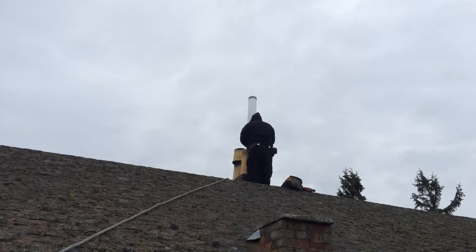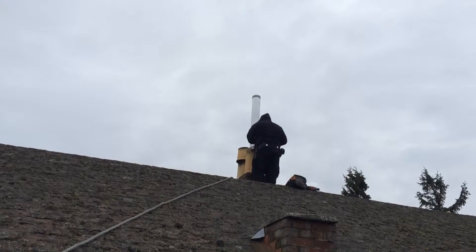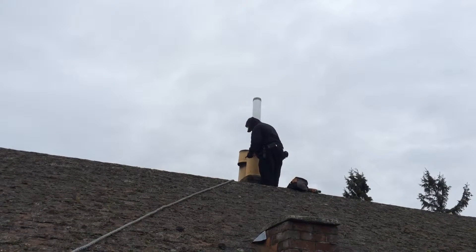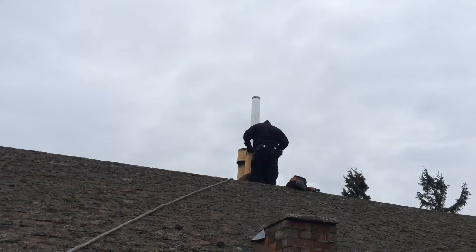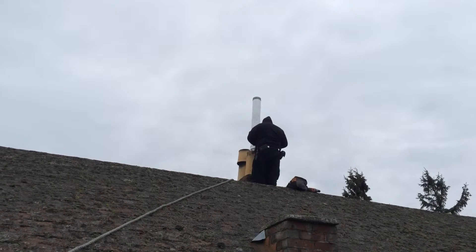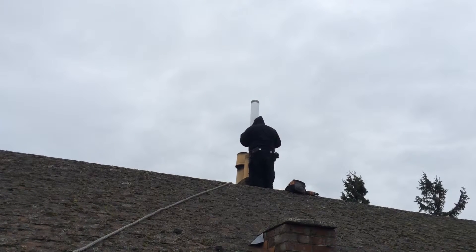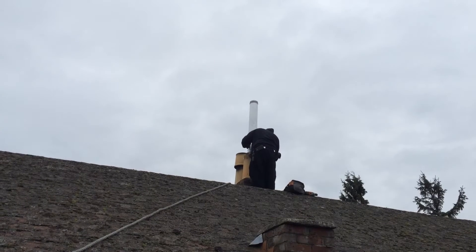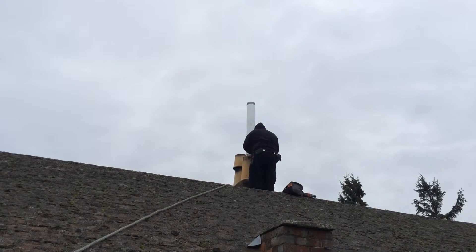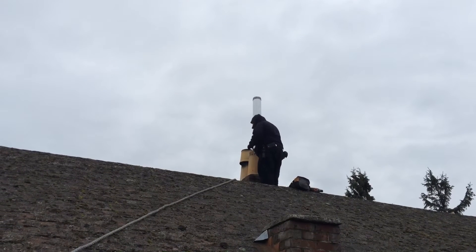With this system being held from the top, it gets four rivets and the rivets can't walk out. They supply their own rivets, so if it falls apart it's basically their fault, but they've got a certain tested system. It's a listed system, so the rivets are all part of that. They're labeled as well. If you have a screw that walks out on a top-hung system, the whole bottom can fall down, leaving an incomplete section of liner that nobody knows about in the middle of the chimney.